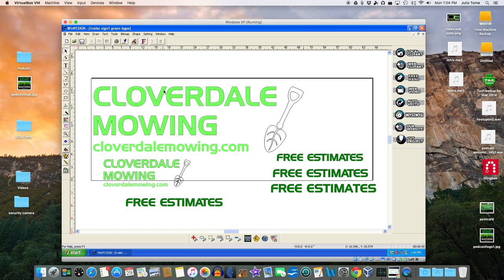There's no color printing or anything in these vinyl sign plotters, as that roll of vinyl is going to be all one color. What you have to remember with sign plotters is that, unlike a regular graphics program or picture program, all the machine cares about is the outlines of the letters. So it has to have an inside and an outside, basically, and that's all it's doing.